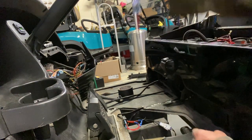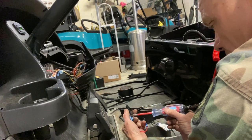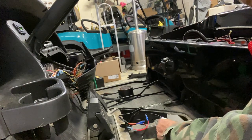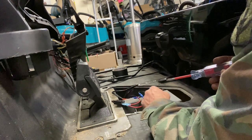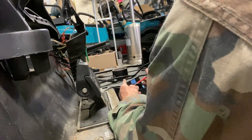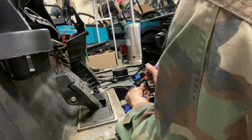I'm going to take my test light - yep, I got 16 volts with two batteries. The wire coming out of this circuit breaker into the connector for the plunger switch has 16.5 volts. So I'm satisfied going into this white connector - one side has 16.5 volts. The other side goes over to two plus and I got nothing. Now let's see what happens as soon as I hit the brake pedal - there it goes! As soon as I hit the brake pedal it pushes voltage through that plunger switch over to the two plus.